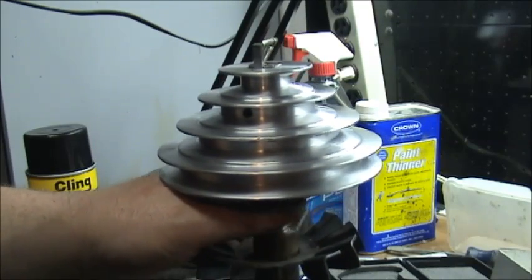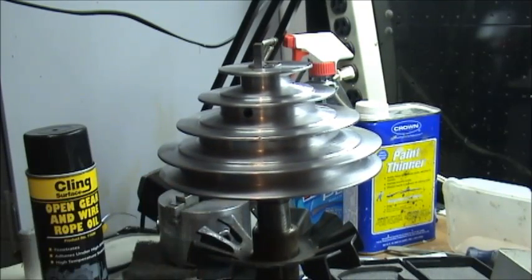That's the easiest way to cut a key seat on a lathe, rather than messing around with broaches. Hopefully those bearings will come in soon and I can get this whole thing back together again. It's all painted up and ready, but once I get the motor on, I'll do a quick video comparing the sound it made before to how it sounds now.